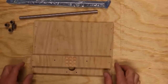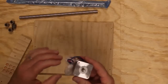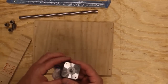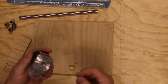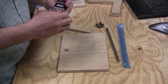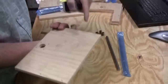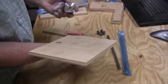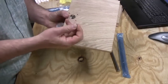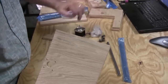Before we actually do any drilling or assembly, we're going to have to test a few things. First of all, we can't tell you what size of mounting screws you're going to need for your stepper motors because stepper motors vary continuously in price and availability. They may be number four, or in this case they're actually M3 — three millimeter. Because of the heads on here, we're going to end up countersinking the inside, so the bed does not hit them. That may vary depending on where you got your stepper motors.